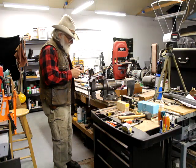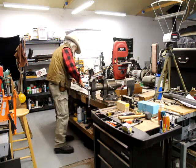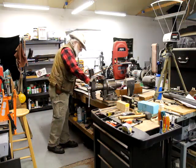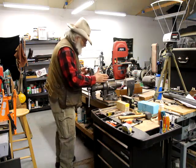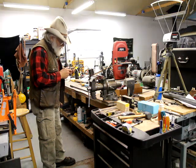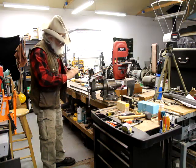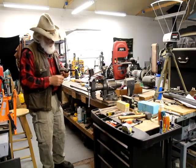So this thing's ready to start to work with. It's got some mars on it and some chisel marks. Somebody else tried to take this barrel off before I did — it was nicked up a little here, and I nicked it up quite a bit more. There are some nicks in here; I don't think those came from me because I had it in there really, really tight and it didn't move. So I'm going to clean them up right now with a file. I've got to take this finish surface down, because on this one I'm going to take the case coloring off and I might redo it.